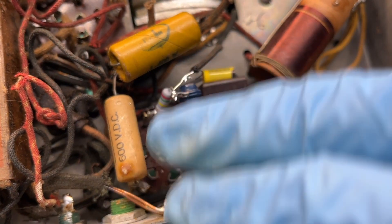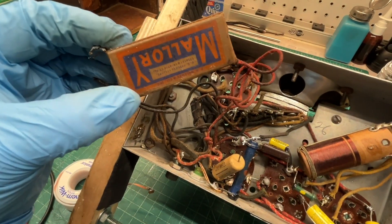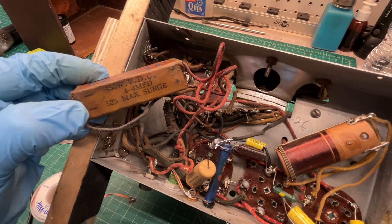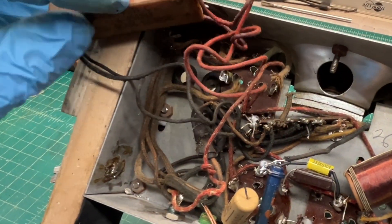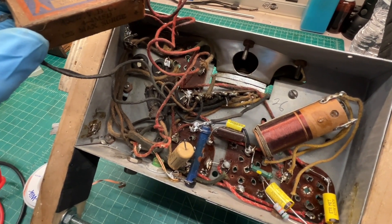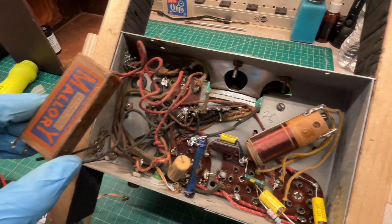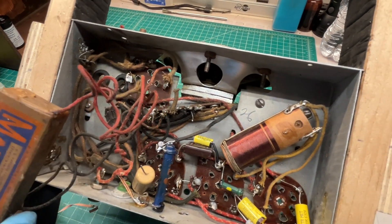Just tacked in for now — I'll clean this up again assuming the receiver actually plays when I get to that point. That's where I'm going to leave off today. You can see I've got the capacitor box out — the dual caps, 450 working volts, 4 microfarads, 525 max surge. Cool box. I can get down here and look at these lead wires I was talking about. I'll probably just tack in some electrolytics for now, cut this out, and look at restuffing possibly. A few more caps to go and then we can power this thing up — isolation transformer, variac, bring it up slow and see if we can get anything out of it.